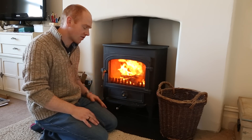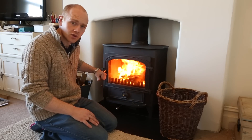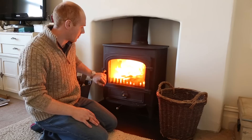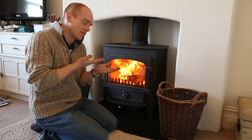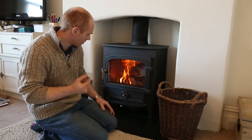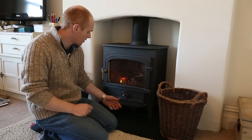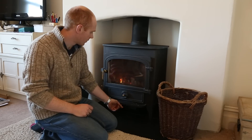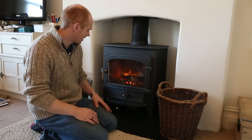It's been going a couple of minutes now and as you can see it really takes off pretty quickly — the vent is fully open. You can leave the door ajar at this stage — it really helps. At this point you can slide in this little adjuster, which is basically a small steel plate closing over the aperture on the bottom of the stove. You can close that right down and it really is very effective — you can vary what you want to do with the fire. If we're going overnight like we tried last night, we just rammed it all the way in and it just ticked away. If I pull it out again you can hear the air coming through underneath and that really takes off again.